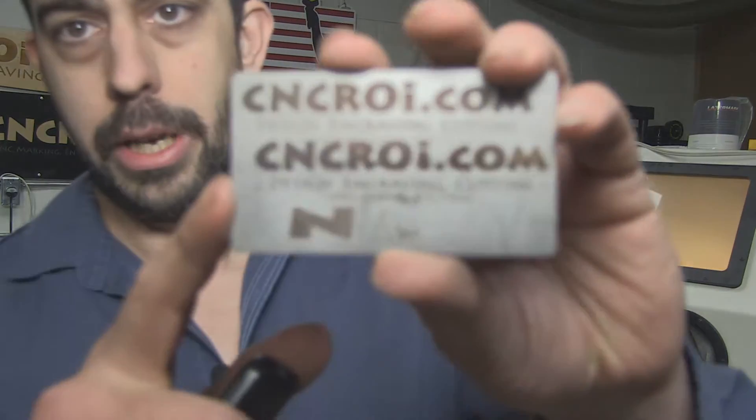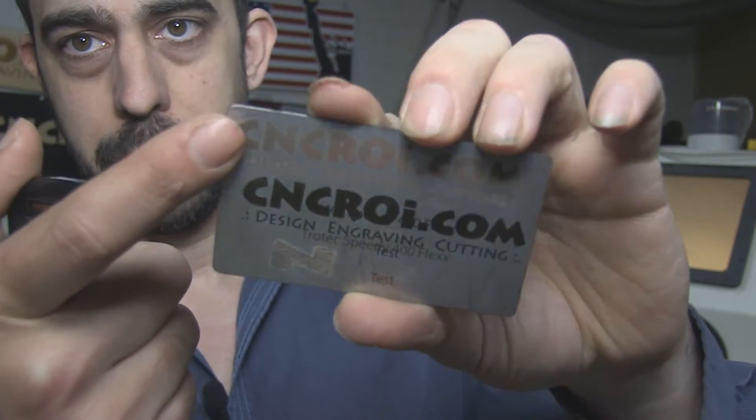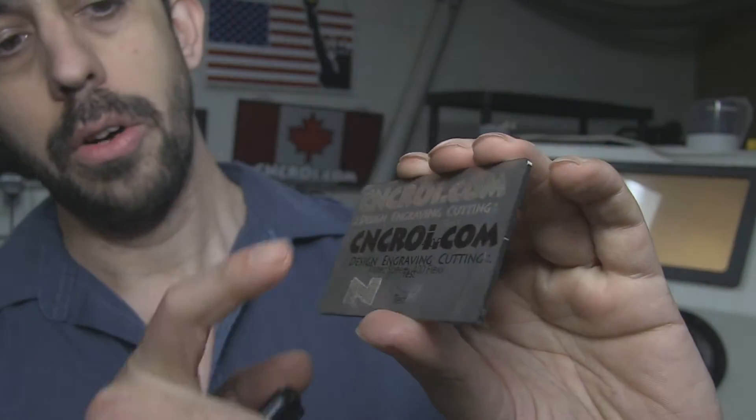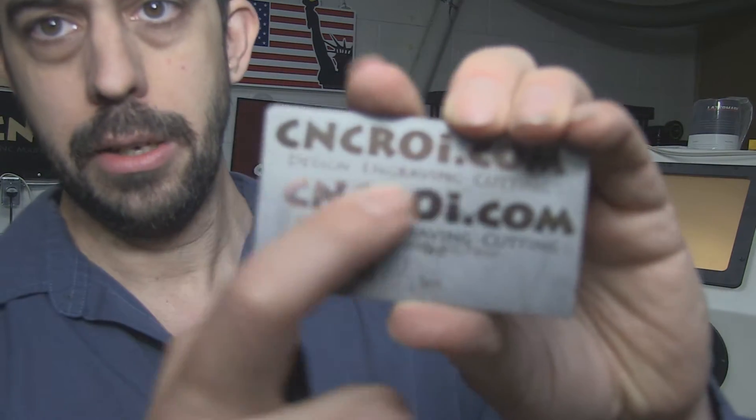A question you might have is if annealing and etching take basically the same amount of time and cost the same to do on a stainless steel tag, why would you want one over the other? If you notice, the annealing is nice and black and visible, while the etching is not as visible. So it's purely an aesthetic choice. Also, if you're doing a lot of cleaning, the etching is very rough and you'll get particles stuck in it. So for the food industry, we always do annealing because it's really smooth, while for more industrial processes — a tag that goes outside or is exposed to the elements — we'll do the etching, because it's just an extra bit of extra marking.